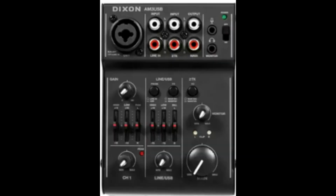Alright, next up, just to finalize the settings on the little mixer that you'll use as well. It's a USB sound card, so obviously you'll connect that to a USB port of your PC, just as you would with the small USB sound card. This one you would connect with a cable. It has to be in the on position, and you'll only use the line in inputs of that little mixer, the RCA inputs. All the others you'll leave alone, and you'll see there's 3 buttons. All those buttons you can just leave in the upright position. So if you click it in, it's down, just leave it in the up position. And the equalizer settings you can all leave in the mid-range.